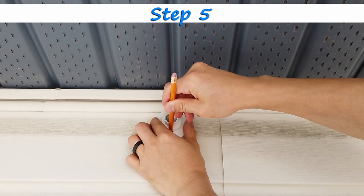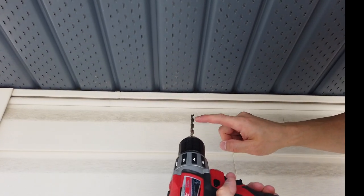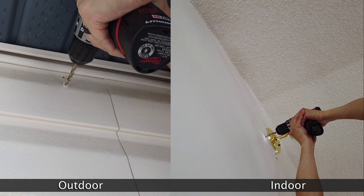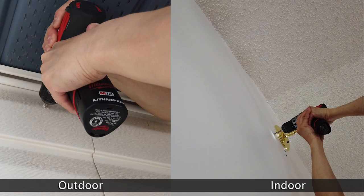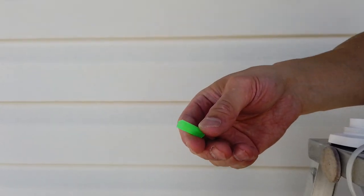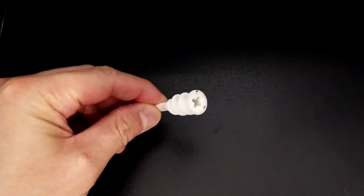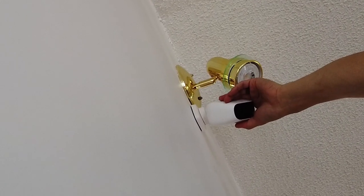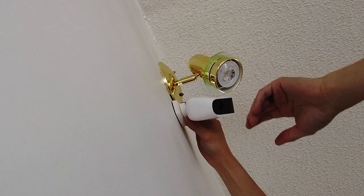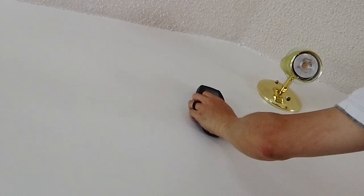Step five: mark and drill out the holes for mounting the cameras. Drill size is found in the installation steps by Eufy. Use the supplied plastic screw anchors where appropriate. Make sure to use appropriate anchors for whatever material you are drilling into. If wood, then the supplied plastic anchors will do fine. On the other hand, if mounting into drywall, you might want to use self-drilling drywall anchors like this — otherwise you might end up with a loose mount and a camera that will one day fall out. Alternatively, when installing in drywall, you can use a non-drywall anchor like the one supplied, but you will need to drill into a wooden stud behind the drywall. In this case, using a stud finder is a must before you drill.